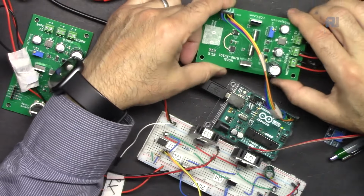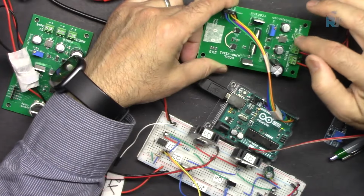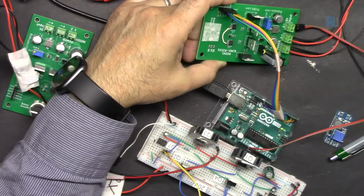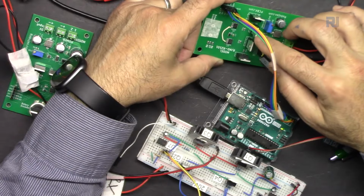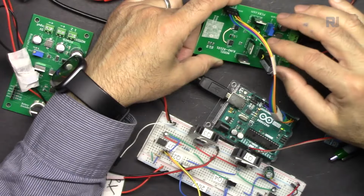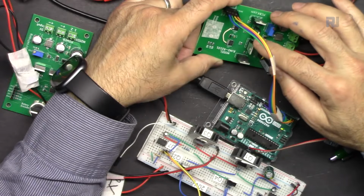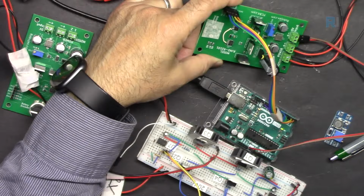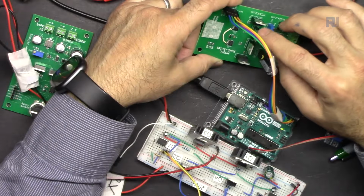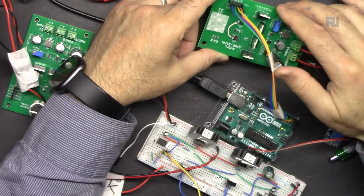So in order to make this gate driver work with all voltages, I've used here a boost converter that gets 3.3 volts or 5 volts and converts it to 20 volts. Because gate source voltage is plus minus 20 volts, so it's very safe to supply up to 20 volts to the gate, and this way it's fully saturated and it acts as a best switch. And also this MOSFET has 17.5 milliohm RDS on. When drain source is turned on, the resistance is relatively very low.